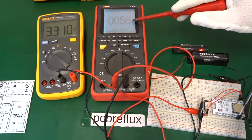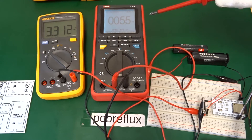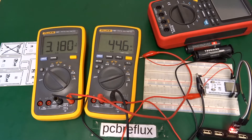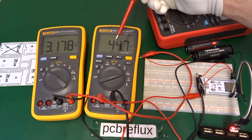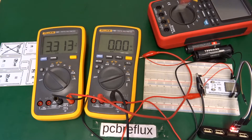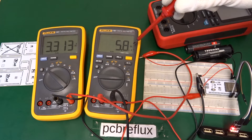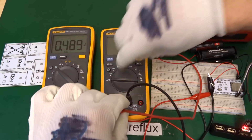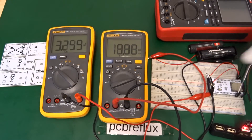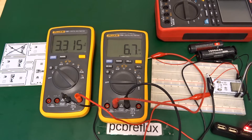Switching back to normal readings, we see a value of about 5-point-something microampere in deep sleep mode with just the RTC enabled. Now the same measurement with the Fluke meter: starting in the milliampere range we see about 40 milliampere, and after entering deep sleep and switching to the microampere range we again see 5-point-something microampere. I then flash the GPIO deep sleep mode so we can wake up the ESP32 with the GPIO0 pin, and the current consumption in deep sleep mode goes up to about 6-point-something microampere.